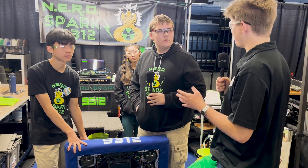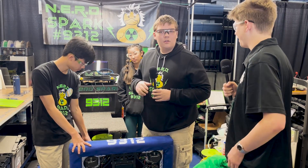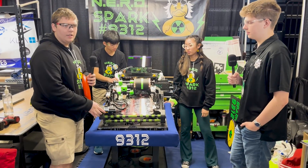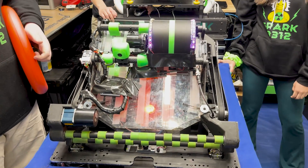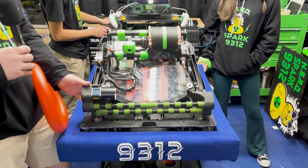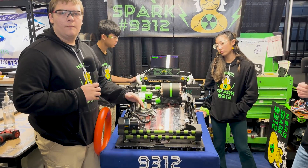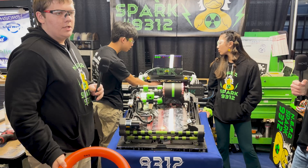Fantastic innovation, NerdSpark. I understand you've shared this design with the community as well — understandably so, why you guys are able to win a FIRST Impact Award in just your second year when you're doing cool things like that. Bryson, why don't you keep us going with the intake? So our intake is a custom intake that we designed. Most of our robot up top is actually 3D printed, or at one point was — we switched a couple of pieces to aluminum. Our intake plates are all custom 3D prints. We have customized gearboxes on both sides, which transfers from the motor and inverts the rotation between top and bottom. And we went with an over-the-bumper intake this year.